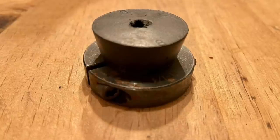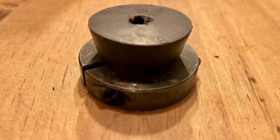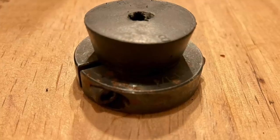During the trajectory of that project, I started putting in things like a harmonic tuning weight that I was moving back and forth on the barrel in the form of a collar weight. And it worked great. The physics behind it: as you move that weight back and forward, the closer I got it to the muzzle, the more ability I had to manipulate those harmonics. The problem with that design, though, is I had to take the shroud off every single time, move the weight, and measure to see where it was on the barrel. I couldn't turn that into a consumer product. So it worked, it just wasn't scalable to what I was looking for.